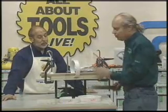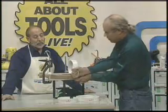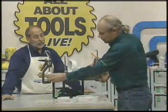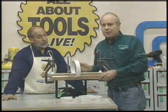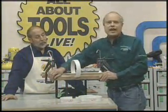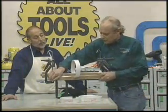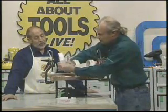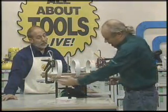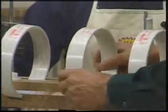Now, the advantage is you put a clamp on. All you have to do is put your glue on the back side, you pull the clamp forward, you stick your edge on. Now, the advantage of Danny clamps over every other clamping method, including the tape, is you can't move your edge after you get about 30 pieces of tape on it. This way, with these type of clamps, you are able to move and align everything after you clamp it. No matter how many you put on. All right, that's a big advantage. Now, if you wiggle them a little bit, they self-align automatically and your edge won't move at all.